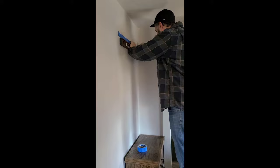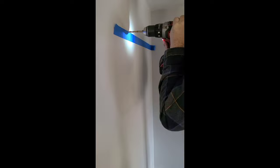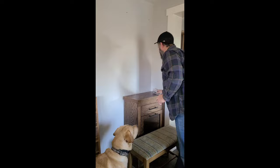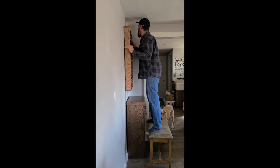To make sure everything's nice and level, take a level and line it up with the painter's tape. Adjust as needed to make sure that the entire edge of the painter's tape is nice and level. Then on the exact location of where you marked those keyhole spots on the tape, you want to drill your holes. If you're putting drywall anchors in you'll need to make a hole for the anchors, or if you're just using a nail you'll use the hammer and nails exactly on that spot. Then simply take the painter's tape off and the nails or screws will stay in place exactly where they're supposed to. Be sure to clean up as you go because it'll make some drywall dust. Then grab your item and simply hang it on the screws or nails and everything will be nice and level.